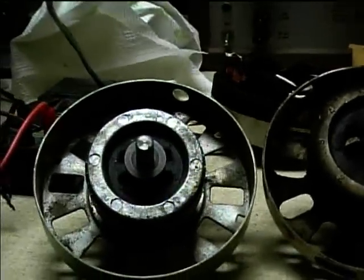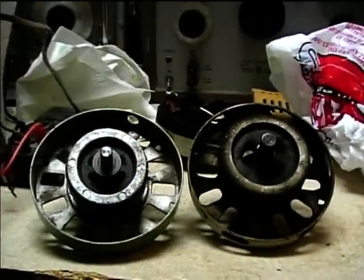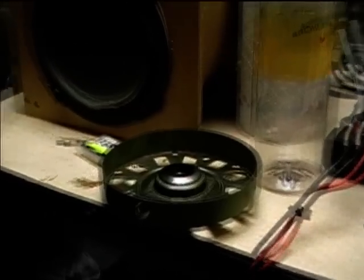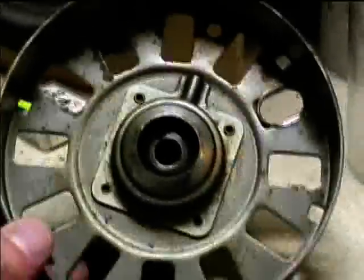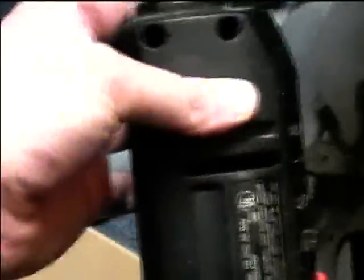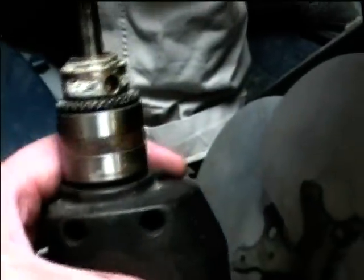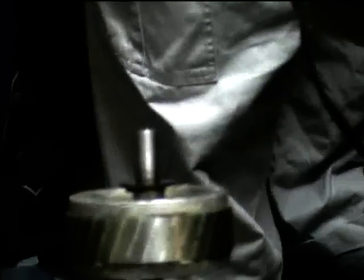It may be possible to get the old motor working or put new bearings on it if it's got a bearing problem. I've got the motor — I tried assembling it and I noticed it's having trouble with this rear bushing. I filed it out a little bit. I'm also working on the motor shaft — I've got it here in the drill, and I'm going to grind off a little bit of the shaft. It's helping; I think I might need to polish it a little bit more.